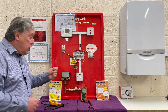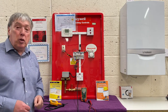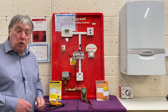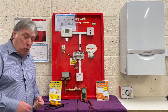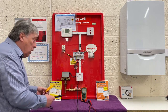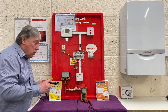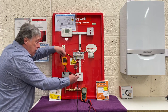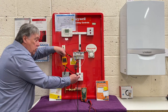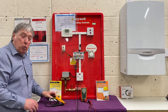Changing to a 3-amp fuse is crucial, because if it isn't 3 amps you can blow the system apart and also the PCB inside the boiler, which is not helpful. So the first thing we do is earth continuity. We put this to the screw and down to here, and there's no light showing — therefore that should be dead, but it shows that the earth is continuing without voltage.